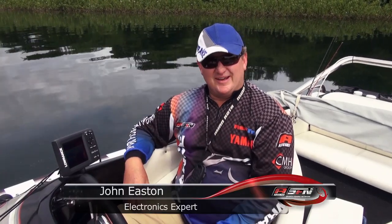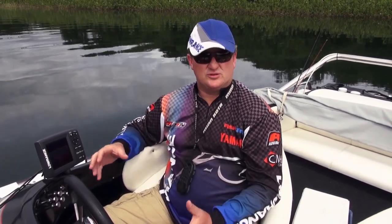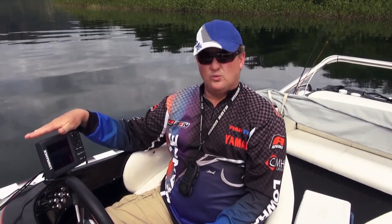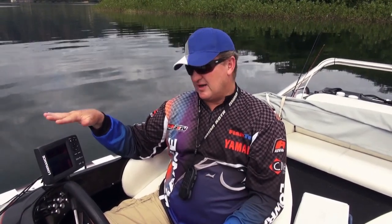We're back at our favorite dam, Inanda. Over the last two weeks we've been talking about the Elite 5 by Lowrance — the 5-inch color unit with GPS, a combo unit with standard 83/200 kHz traditional sonar. What we're going to be doing today is using the Lowrance Elite 5 DSI, which has a high-frequency 800 kHz and 455 kHz unit with GPS, and with one major difference on top of that — it's color.